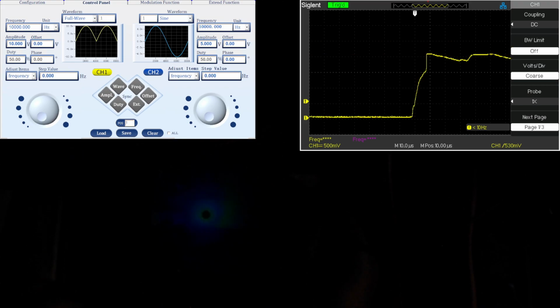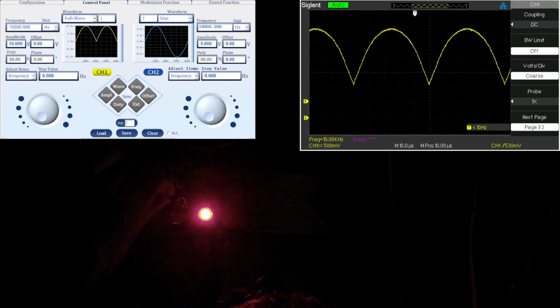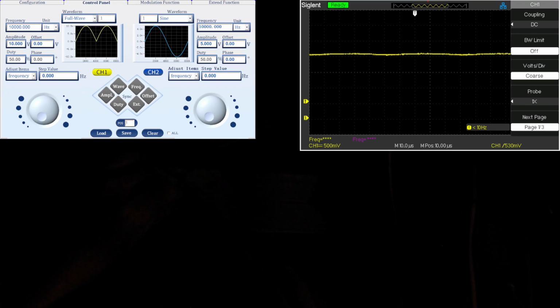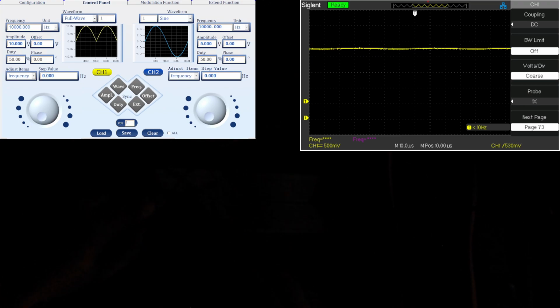All right. When I remove this 100 microfarad capacitor off of the back end, we get slightly more ripple back there. I'm going to move it over to the front end, between the first leg of our resistor and ground. You see now we filter out there, and there was a slight, ever so slight reduction in the brightness of our LED, but we got rid of that ripple on the front end, and we kept the back end of our circuit very clean as well.